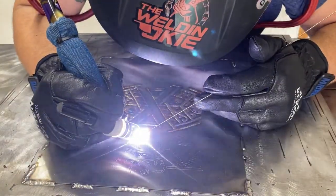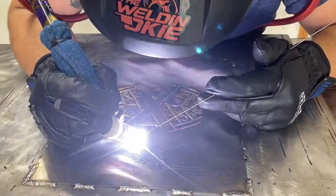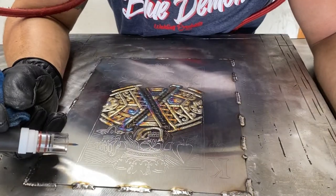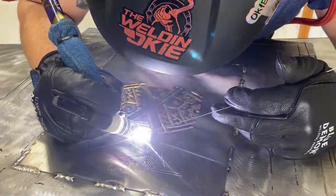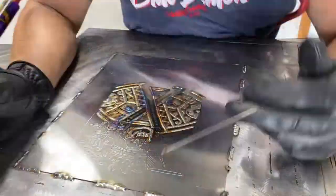I should have covered it already, but I didn't. I'm running on 20 gauge stainless. That is about the thickness of a razor blade. And I have my machine set at 40 amps. There will be times when I'm only using 10% of that pedal, but I want it when I need it. My flow rate to start is always set at 30 CFH.